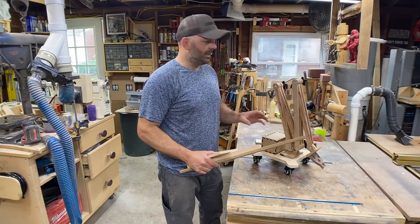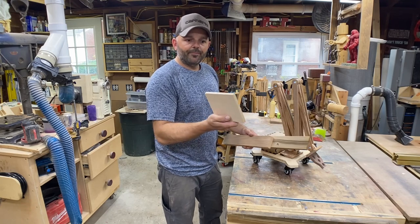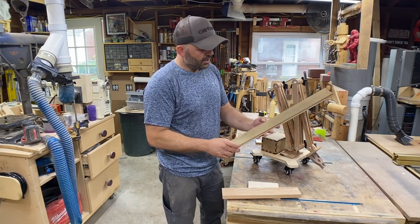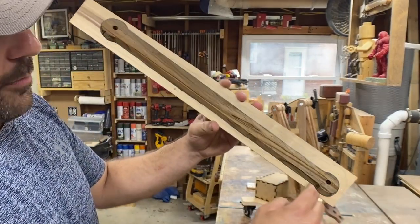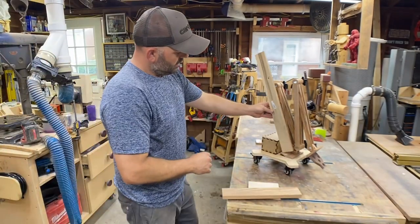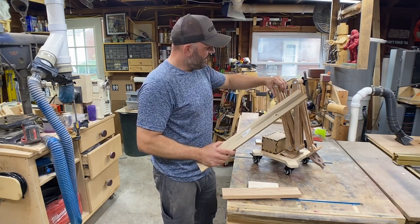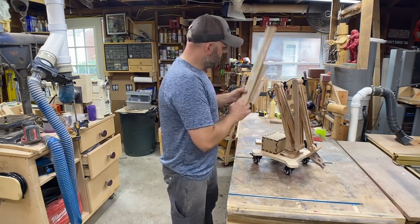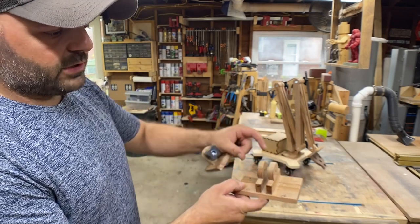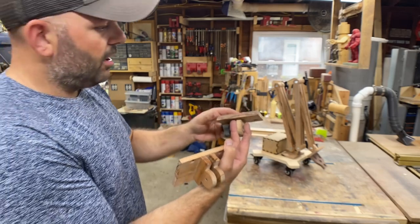What's great about these is you don't have to have a CNC or a laser to cut them — that just makes it easier. You can cut any one of these stanchions out of any kind of scrap you have in your shop: Baltic Birch plywood, some oak would be real nice, or I've got some poplar here. This is already half an inch. So you could draw your dog bone there, connect them on each side, drill a center through-hole, and that's where your bolt sticks through. You can shorten or lengthen this — it's incredibly versatile. You can make extra base pieces: this one holds three arms, this single accepts two, and this is where you could have your light, your camera, whatever you want.